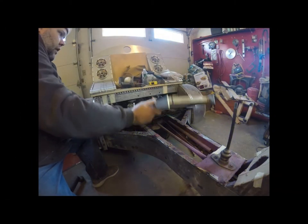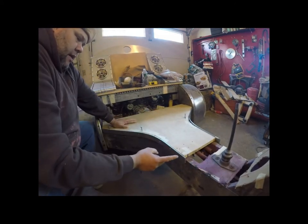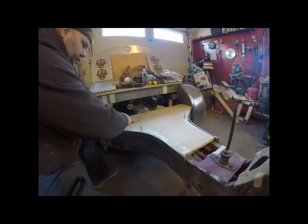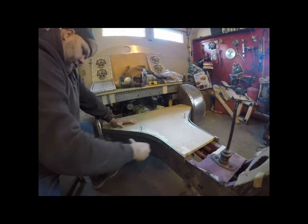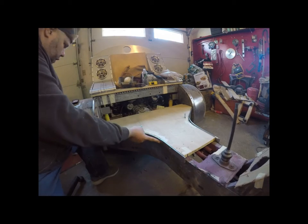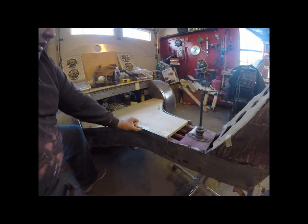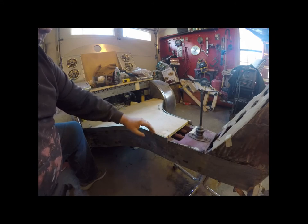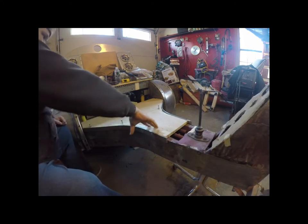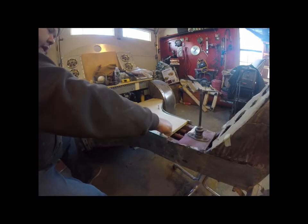So I cut out the wood and cut out the metal. I cut the piece — it was straight metal — and pushed it in, then used clamps and my big C clamp for holding the metal while welding. I was able to pry it to hit the curve, then counter-sunk all the holes. With those sunk, they'll be flat and I can spot weld them in so they won't back out. Once all this is taken care of and the back piece is in, we'll be able to cut the sheet metal to laminate, then spot weld it throughout.